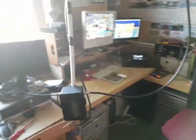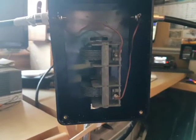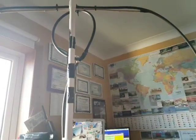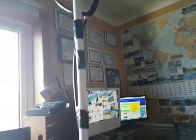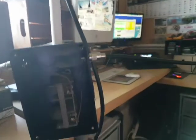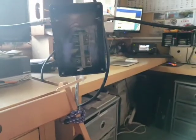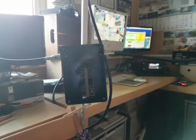So it's working, much to my great surprise. Very simple, actually. I've never wired up one of these before — that was a bit of a challenge, but I figured it out. It didn't work the first time; I replaced the loop. I had RG58 before, so I replaced it with better quality coax along with the feed line, and that seemed to do the trick. Couldn't get it working yesterday, but it's been working great today. QSOs are few and far between, but it does indeed work, and I'm quite pleased. Cheerio.